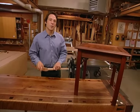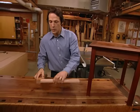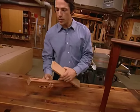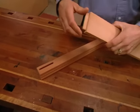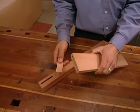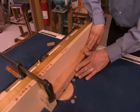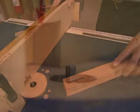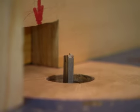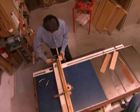While the glue is drying on our panel, we can start making the joinery that connects our legs to our aprons. We're going to be using a loose mortise and tenon construction — we'll be cutting a mortise into our leg and a mortise into our apron, and milling up a loose tenon that connects the two. To make the mortises, we use a two-flute carbide bit at the router table. It's a fast, accurate way to cut a mortise. We've also installed stop blocks to control the length of the mortise on the front and back of the fence.